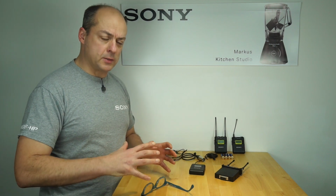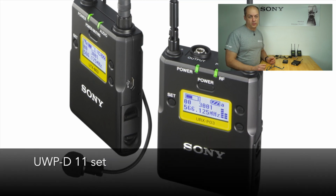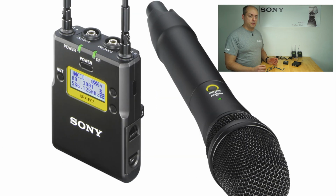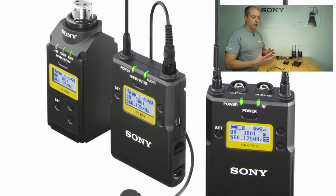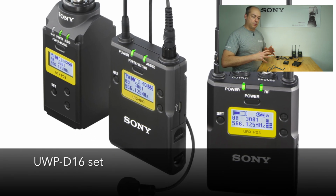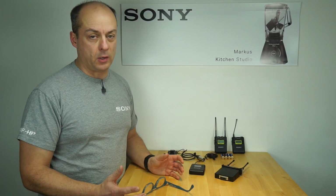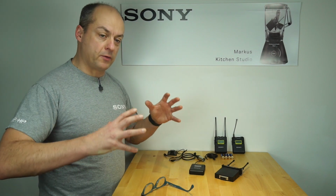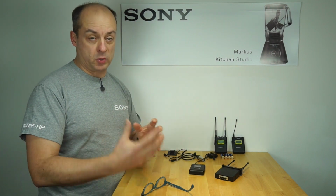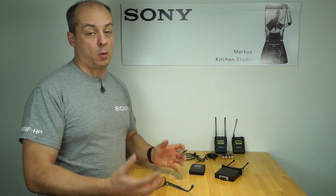So what we have done is not a full digital system. You cannot do a full digital system in this price range with the budget we have. But what we could do is digital companding. The problem of an FM analog modulated system is that the compander is an analog part in the system, which brings the dynamics into the 200 kilohertz band which we have. The digital compander can do it much more precisely.